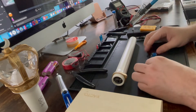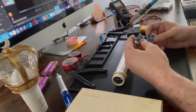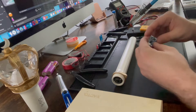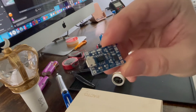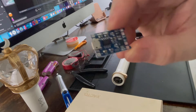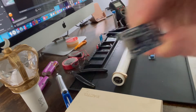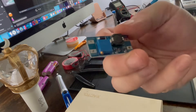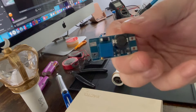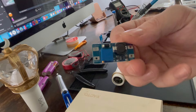The main thing that's gonna drive this is these two PCBs right here. One is called the TP4056 — this is the recharging module, what you actually wire the batteries to. Then you output it from there into this voltage booster, which steps it up to 4.5 volts that we need in order to power this.